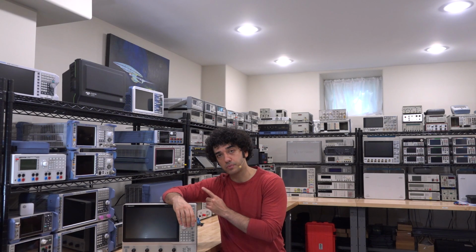And I'm interested to see this particular model because this is a 4-channel 8.5 GHz network analyzer with TDR and spectrum analyzer options in the firmware. It has a fantastic form factor and honestly it works really well. We're going to have to try and see some of its limitations, some of the places they can improve the firmware, but overall this is an impressive instrument for the bench, especially in the price performance ratio, which is one of the things Siglent essentially excels at.